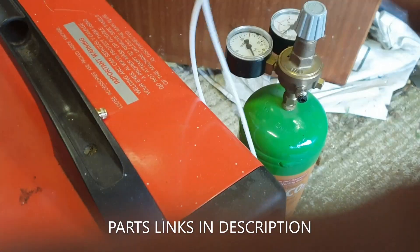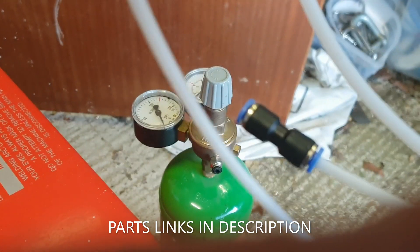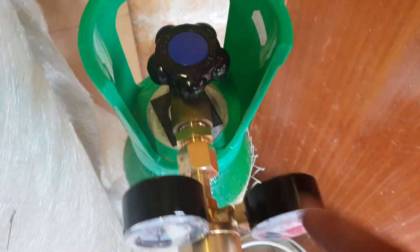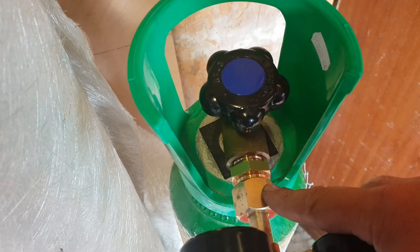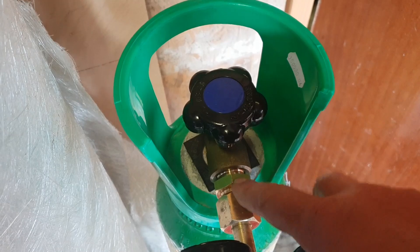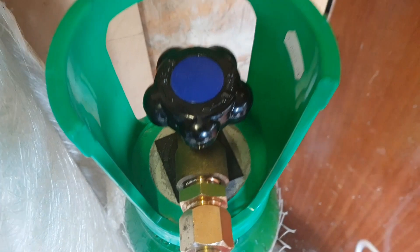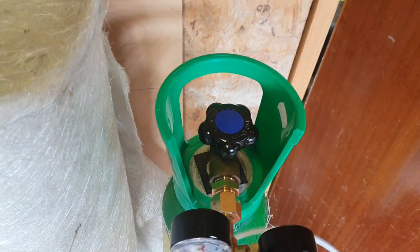So the stuff you need: two meters of Bowden tube for a 3D printer, one connector, and you just need the argon CO2 adapter - that's five-eighths BSP right hand. You can pick that up off eBay or any welding supply. To connect it up, you literally just take this end and shove it in the end of your existing MIG.